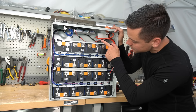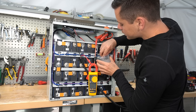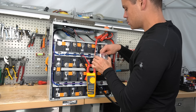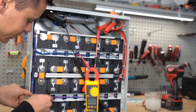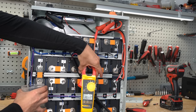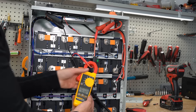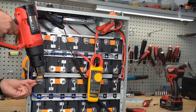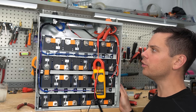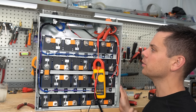Let's test to see if these things work. Let's get some cold water, because this is a new BMS, so we should test the basic features. Right now we're charging with 20 amps - we're going to stick the sensor in some ice water. And there we go, just a couple seconds. Now we're charging again. This is also a different balance cable than their other battery because it has a different BMS. We're going to dunk this one in salt water - and there we go, zero. Now let's heat it up - and now we're charging. So they both work. We're going to test the high temperature - and it works.